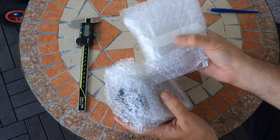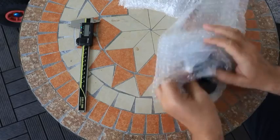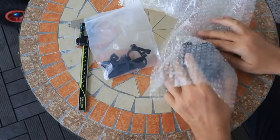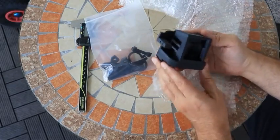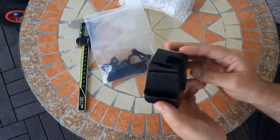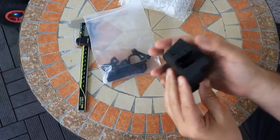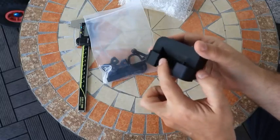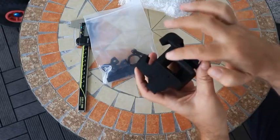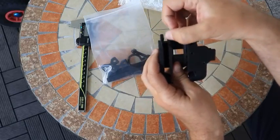This is heavy, so this must be the stainless steel. First I'll open the ABS parts — these are the test specimens. And I also ordered this: the Satsana fan shroud Industry V2 from ABS as a shout-out. I ordered this to test their capabilities because it's difficult to print — you cannot use supports since you can't remove them from inside these channels, and it starts from a very small contact surface.